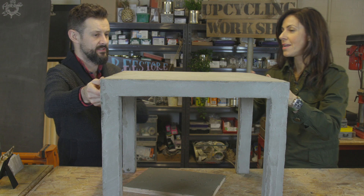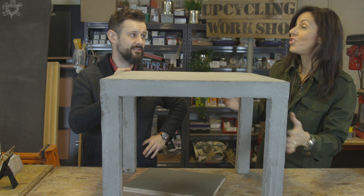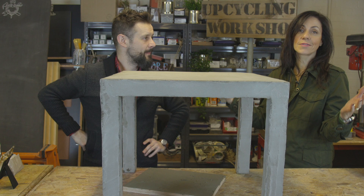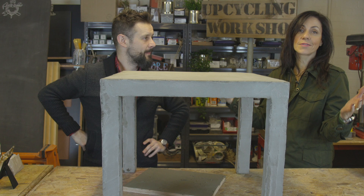So this is an ordinary flat pack table, bought from anywhere, really cheap as chips, covered in our lovely concrete finish, which not only means it looks pretty cool — it also has made it weatherproof. I gave it a very light sand just to take the top off, but look at those lovely trowel marks. If you're going to use it in a kitchen environment, maybe put a bit of matte lacquer on top just to finish it off. And inside or outside, take your pick. If you're going to put it inside though, at least dress it. Nice finish.